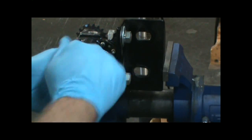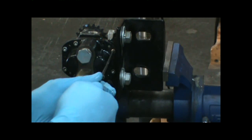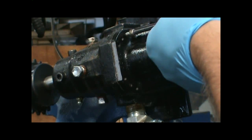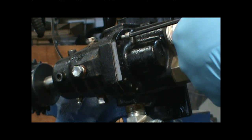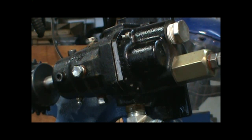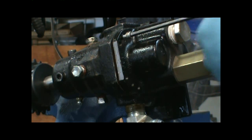Once I have my pump in the vise, I'm going to remove the 8 Allen bolts that hold the back housing on. Once you have all 8 bolts removed, there's a female thread in between the two bolts right here and you can simply use the same bolt and thread it in on one side. As you can see, the housing now starts to remove. On the caddy corner, there's the same thread that you can use to screw the bolt into and it will help remove the back housing. You have to alternate the screw back and forth to get it to come off of the pump.